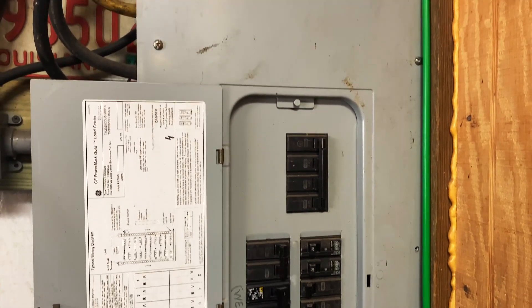Power requirements are another consideration. Even in my 12 by 24 shop I had a 200-amp service because I had welding machines and 220-volt equipment. Whatever you do, make sure you use a qualified electrician that follows NEC regulations and your local ordinances for your power needs. My current shop has 200-amp service and meets all my needs. If I wanted to run three-phase equipment like big power hammers or lathes, I'd need a phase converter or have three-phase brought in — beginning knife makers don't have to worry much about that, but make sure someone qualified helps you determine your power needs.